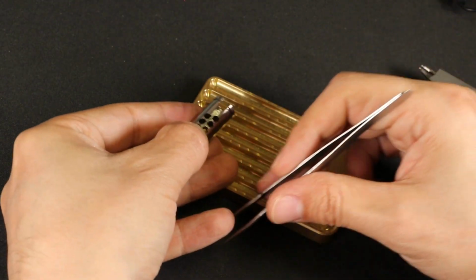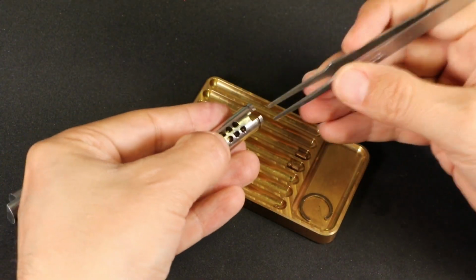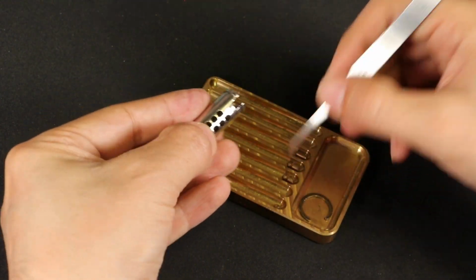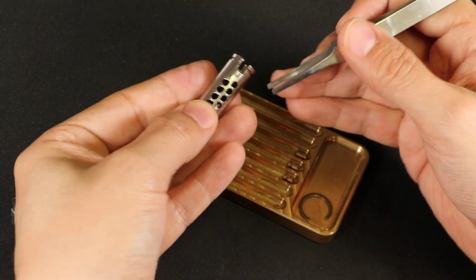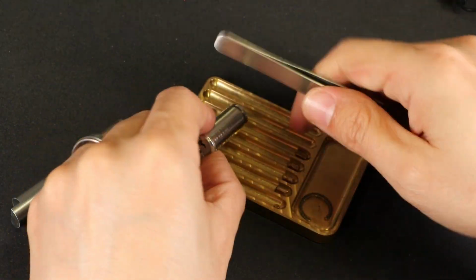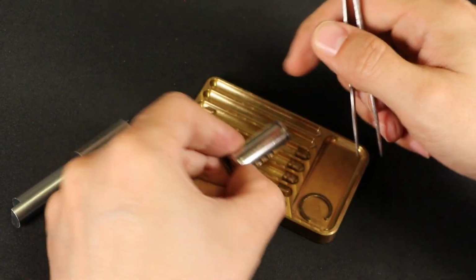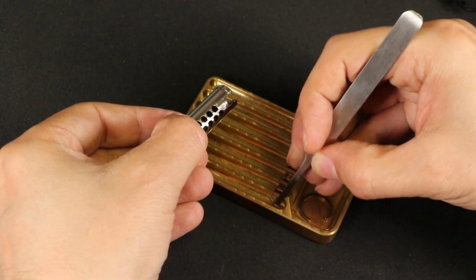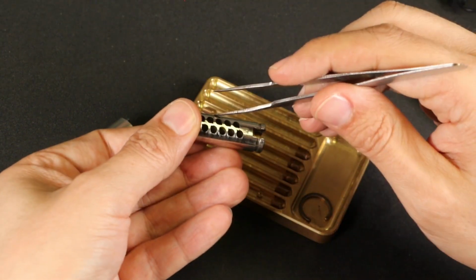You might feel like a spool and you can get into that overset area, the little crevice, whatever it's called. Same thing here. Then it looks like this one here has a steel pin in the middle for anti-drill, and that'll correspond with a steel driver pin. And one of the things I note is that some of these have a curve on the top of them. I don't know why. We'll take a look at that in a second. Nothing special up in here, no milling or anything.